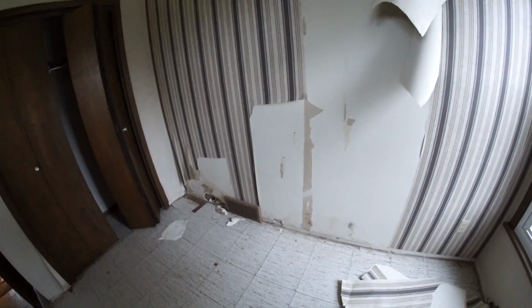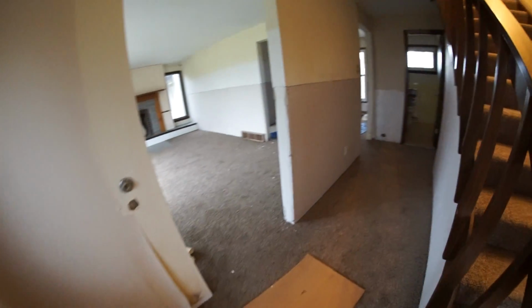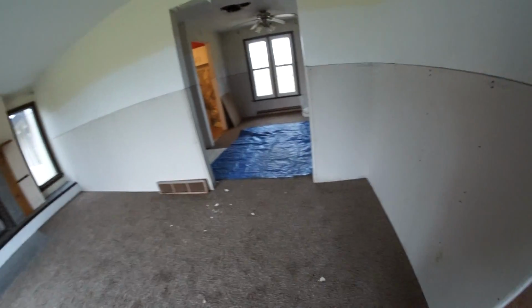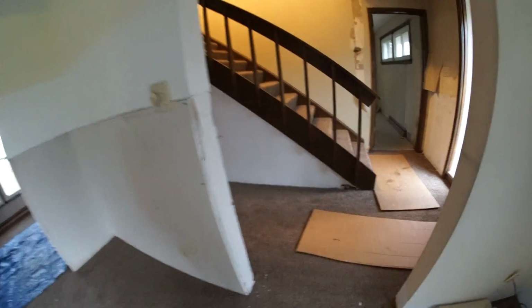Then they probably have to be primed too. This house is going to have to be primed because of all the mold, everything. Ceilings, walls. Plus, you've got a lot of fresh drywall, so all that would have to be primed regardless of the mold, but especially the mold needs to be treated and then covered with the primer and then painted. Get more wallpaper.